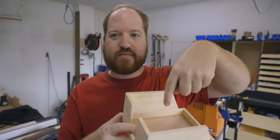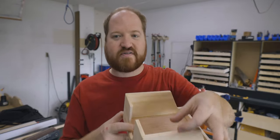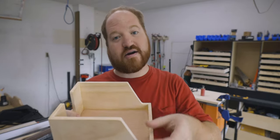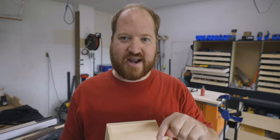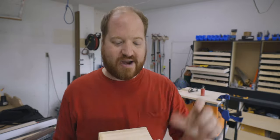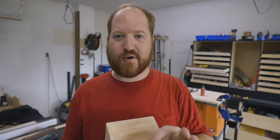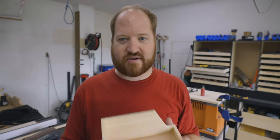It's going to have one part in the middle that has a handle, and then two that come across. So you have two pockets on one side, napkins on the other side, and then salt and pepper shakers on this side. This time I am going to do it a little differently since the handle has a hole in it and a rounded edge. I still have my sander out, so I'm going to go ahead and cut that 2-inch strip, drill the hole, and finish sanding it. Then I'll make the dividers and glue all that together.